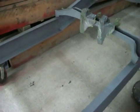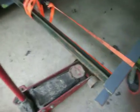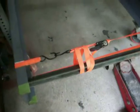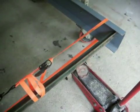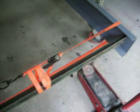The frame came out good — the length is good, it's square. I have a spreader there just to make sure it stays the right width while I'm hooking everything else up, so that when I go to weld it together I don't have any problems with it.